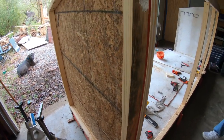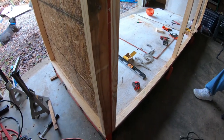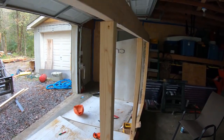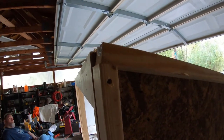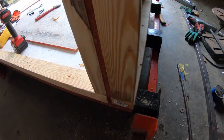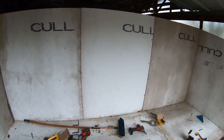I didn't do anything super fancy here — just put up the sides, put the plywood on the sides, and then built the frame on the inside. I used a two-by-six header across the top because I figured I would be connecting a hinge to the top so that I could lift it up and get in there easier. Once I get this thing sealed up real good, my intention is to paint the inside.